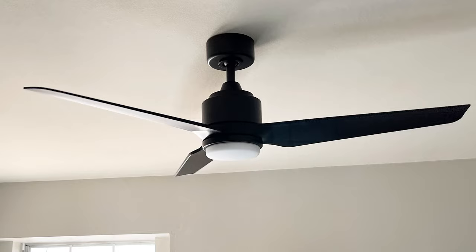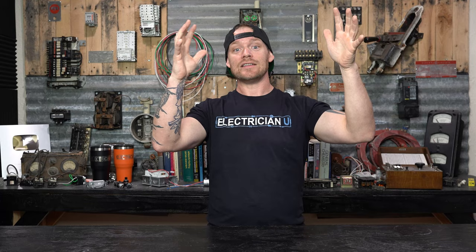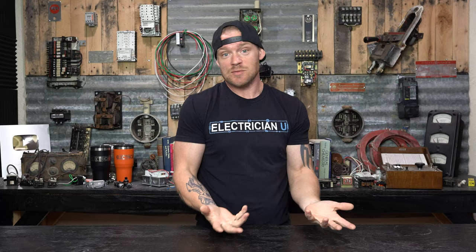The last thing we have to do is make sure the remote works. I open up the remote, put the new batteries in — there are two little flat washer batteries — and make sure the dip switches match the dip switches I set up in the fan. Then I turn the power on. Every fan has some kind of procedure you have to go through. Some fans you just turn on and hit a button and it automatically responds to the remote. Some you have to push a button for five seconds and wait for the light to blink. Reading the instructions is key — every one of them has their own procedure. Read thoroughly and don't skip through, because oftentimes you're missing something really crucial.